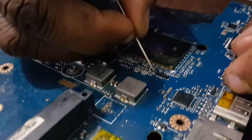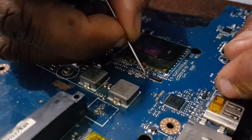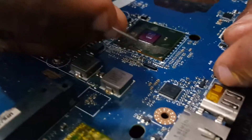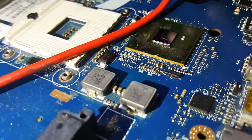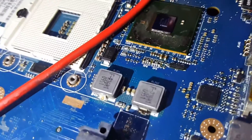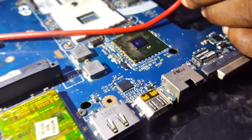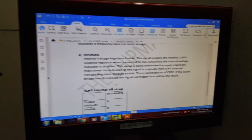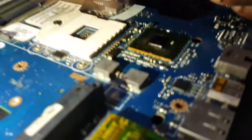Remember: internal voltage regulator module enable — turns on the 1.05 volt suspend regulator inside the ICH or PCH. We are going to disconnect it. As I said in the notes, it says 'very important' — ICH7 internal VR strap. Internal voltage regulator enable — enable is default. Disable is zero, so if you disable it there's no trigger, it's off. If you connect it to ground it will be disabled. We can just disconnect this resistor and see if it's coming or not.